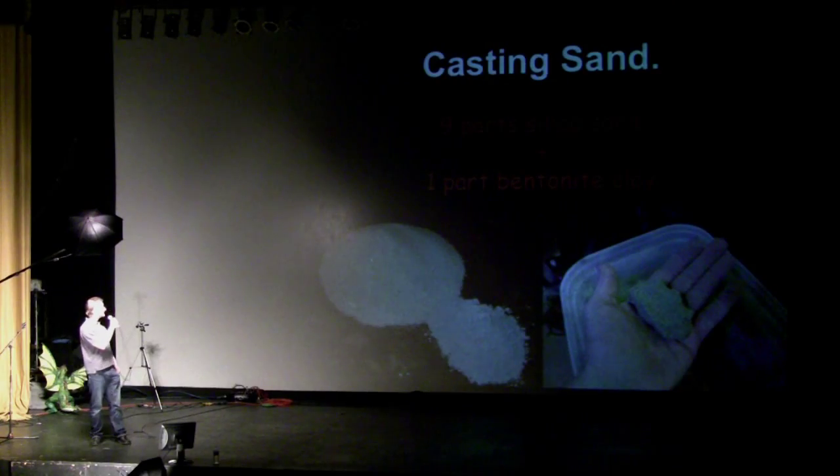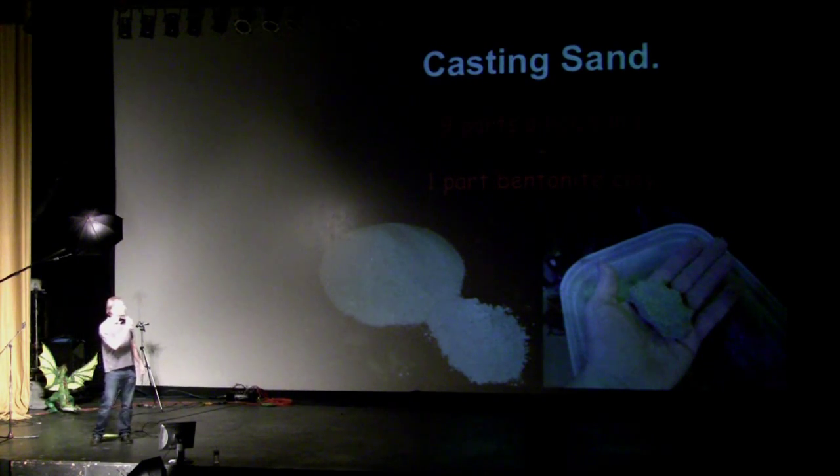You've got to have something you want to make. That comes from sand, and here's the formula: silica sand and bentonite clay — both cheap and attainable. Silica sand you can get at your local hardware store; bentonite clay I got on eBay, five bucks for five pounds. That hand there is squeezing the clay — you've got to mix it at ratio and dampen it with water, give it the squeeze test, and you want it to stick together and hold its form.